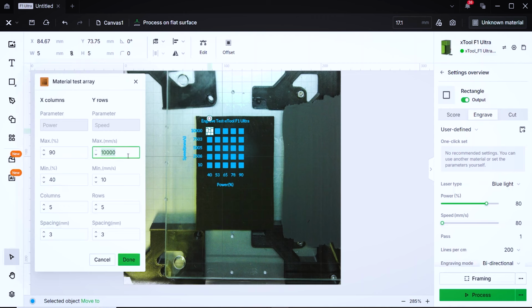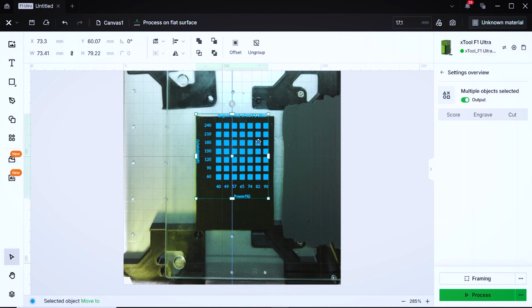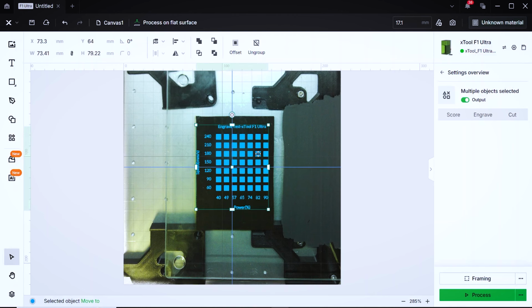And for this example, I sourced a glass cutting board that is certainly made of tempered glass. And I'm gonna be using the laser marking paper again, as well as the Pentel chalk marker. I've taken extra special care to apply both of these coatings as evenly as possible, and based on what I've seen online, the tempered glass should be tougher and more heat resistant, and so I've gone back to a broader range of power settings inside of my material test array.